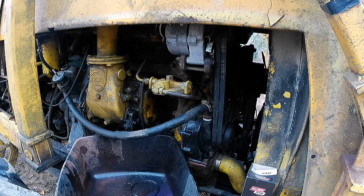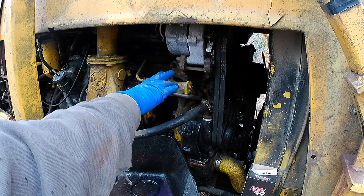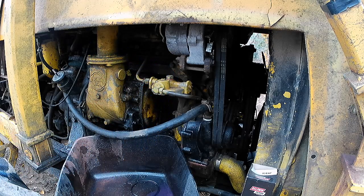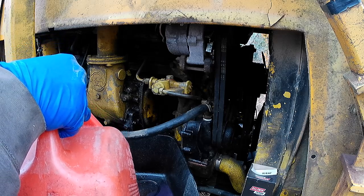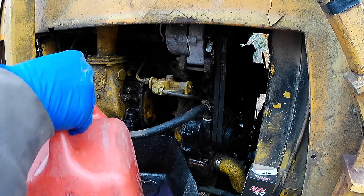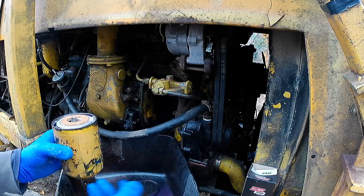Anyway, we can only go as far as the ground. These old engines will not self-prime. If you get one that self-primes, you just won the lottery. You're lucky. Good for you. And it's probably the biggest reason I'm making this video. You have to refill it. If it's a spin-on or a cartridge like this, doesn't matter. You have to refill the thing with fuel. And if a little tiny bit of air gets in there, it'll probably work.